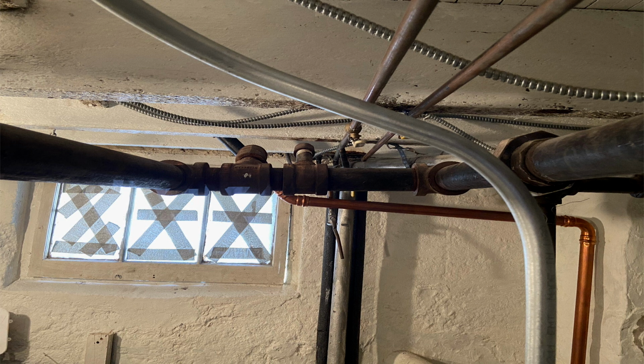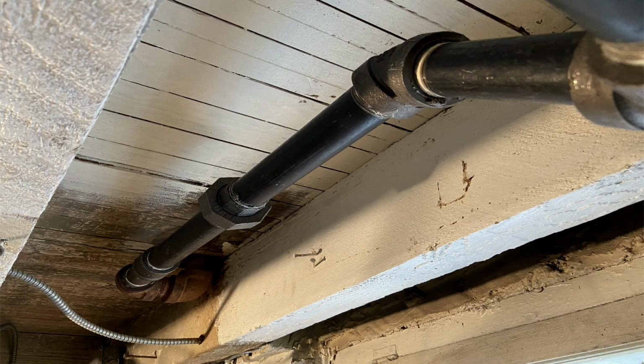And you're going to see that coming up in the next shot here, where he actually put a union in and a coupling to take an elbow out. Actually, in this shot here on the right, the extreme right, he put a T in place of an elbow, and you'll see that coming up next. And he put that return on there to aid in the condensate from that radiator getting back to the boiler.